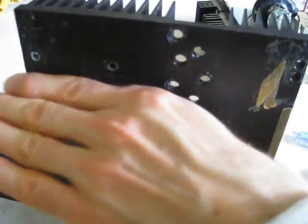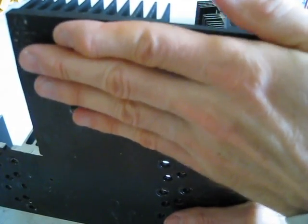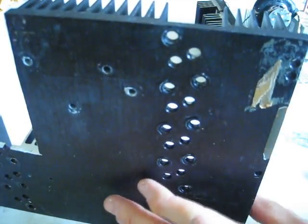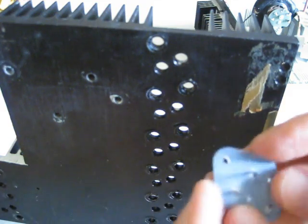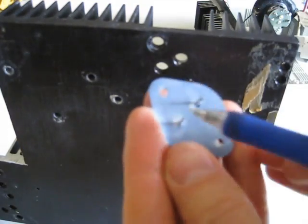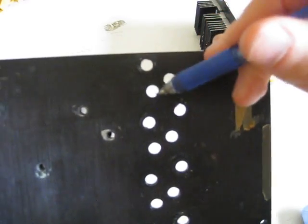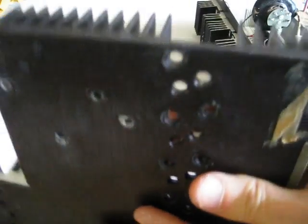Here's my chunk of heat sink. I would just cut off a piece — the case for the power supply would be right here, and this would be mounted to the power supply case. I got this piece at a secondhand electrical shop. Now, which way do you put the transistor in? It's actually unidirectional. The two prongs on the transistor are closer to one mounting hole than the other, and on the heat sink, the same thing — so there really is only one way to put it through.